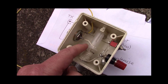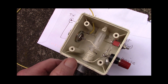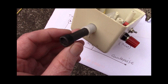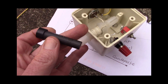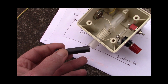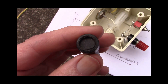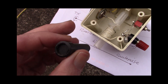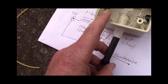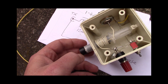This is about 12 millimetres diameter and that by itself gives you about 1 microhenry. This tube is the same diameter as a piece of ferrite rod — this is from an old transistor radio and it's been cut to be a bit shorter. I've put some plastic tubing on the end as a handle — I think it's irrigation tubing. That slides in and when it's slid in, the inductance increases up to about 4 microhenry at maximum.